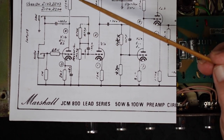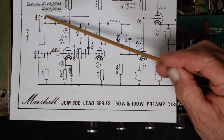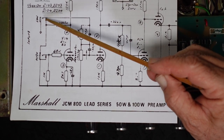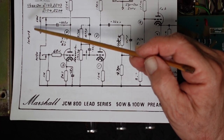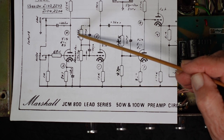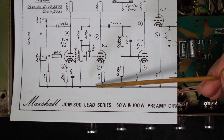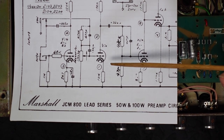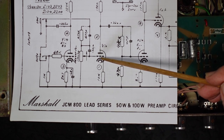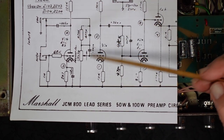So if we just look at the low input signal, when there is nothing plugged into either one, this little contact here and here grounds out those inputs, make sure there's no noise. When we plug a guitar in, that contact there opens up, and now the low signal path goes here into this potential divider network, half of which is a volume control. Now, we know this is going to sound like crap because you know how small a guitar signal is. You're talking millivolts to measure it, 100, 200, 300 millivolts. So here we're dividing it even smaller before we feed into the first gain stage for the low input. That's why it's always going to sound like crap. I don't know that many people would use the low input.